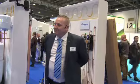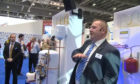Brilliant. Okay, just one final question. Yep, fine. Feeding domestic boilers with warm water, is that something that the system does? Right, different manufacturers will do either a solar ready combi or a solar ready boiler. Because the solar is a secondary heat source, we'd have to have a twin coil cylinder. What we always do is use the solar as a preheat system into the bottom of the cylinder, and then the primary boiler will go through the coil. So you're not sending it through the boiler, it's going through a cylinder, preheating in the bottom. If we can preheat up to, say, 30 degrees in winter, that's basically cutting the gas bill in half, because it takes about the same amount of energy to get from 6 degrees incoming to about 30 as it does from 30 to 60.